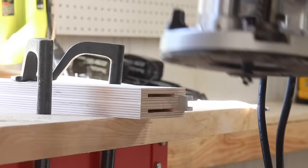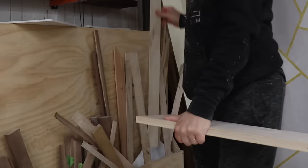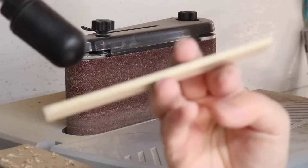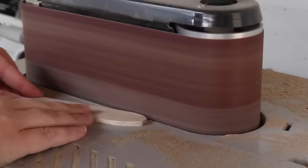I found some material in my shop that's a perfect fit, so I don't have to mill anything up — I just have to cut it to size. I'll glue the splines into place on the extension part of the fence, not the main part. I'm not going to use a lot of glue because I really don't want squeeze-out. The pieces now fit together and align really well.